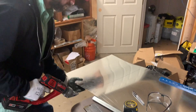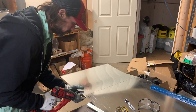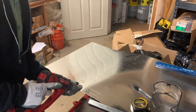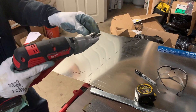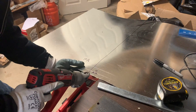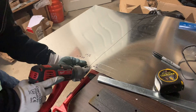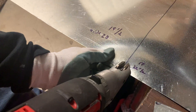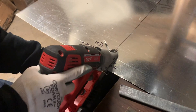On these cuts, I like to take the line off. You want to remember where you marked as far as what side of your shears you go on. As you can see, I'm starting on the inside of the line and I'm going to take the line with me.